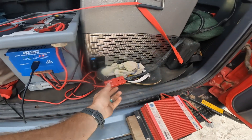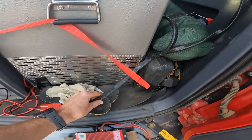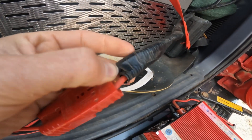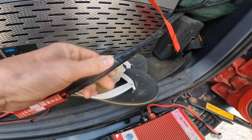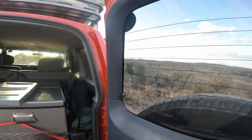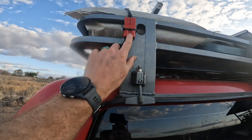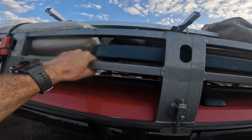The cable runs through an Anderson plug with an extension that is wrapped in plastic sheathing - each one individually wrapped so they can't short out, then double insulation-taped all the way through. It's quite a long cable; I run it through the window and out to another plug, then up to the solar panel on the roof.